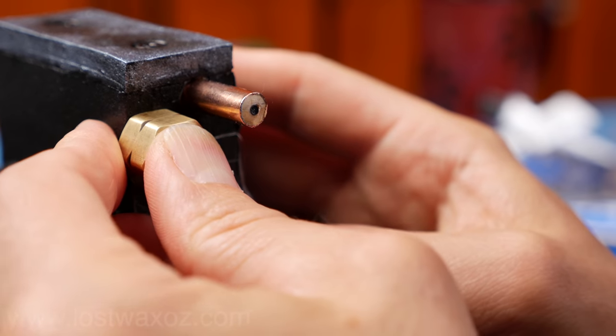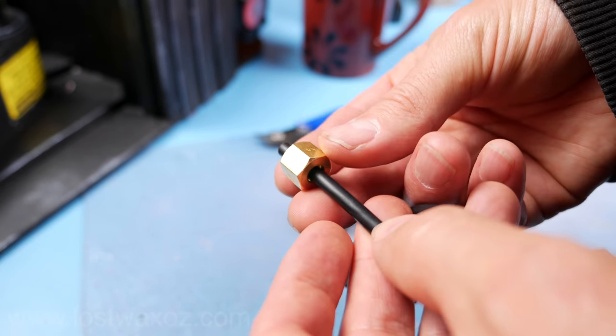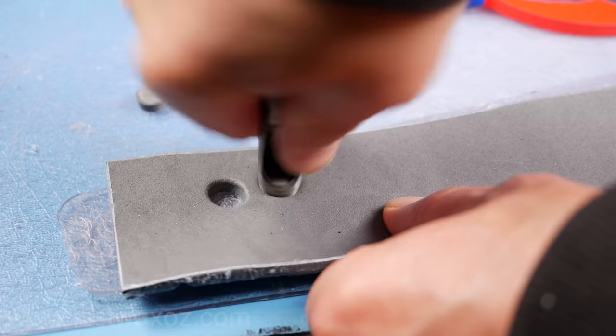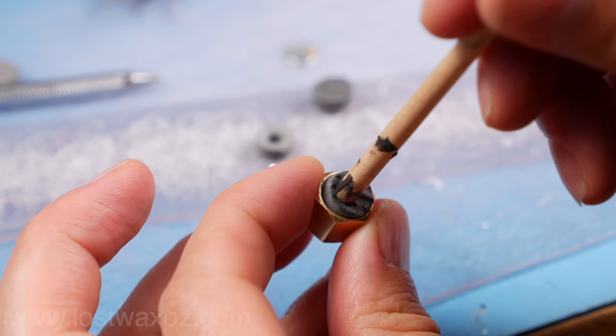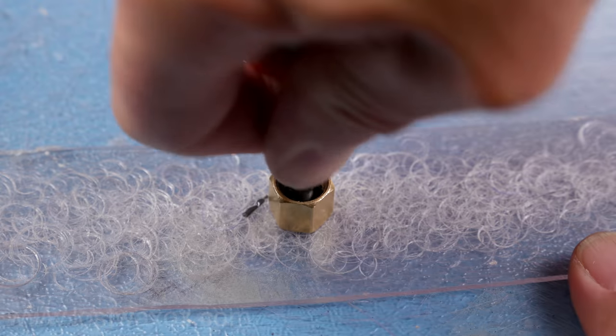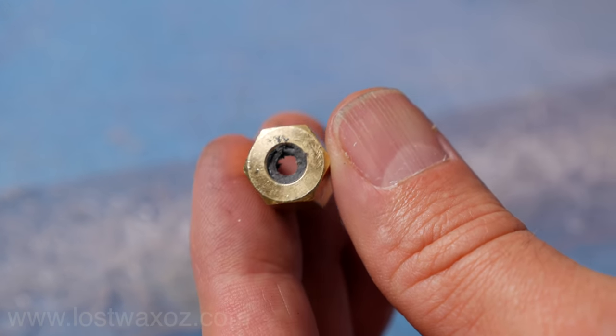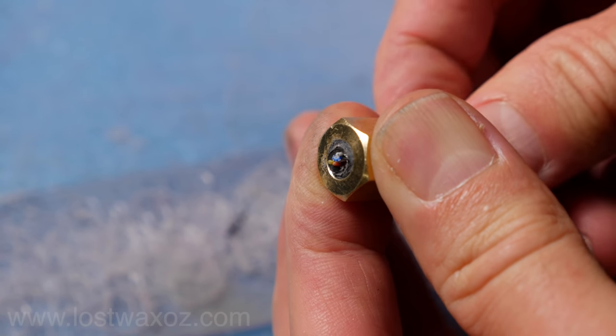The last two compression nuts are going to have the VGA wire coming right out of the center hole, but it's a little too big. So cut a foam disc and epoxy it inside the compression nut — do it again so you have two of them. Once the epoxy's cured, use a small punch right in the center to give yourself a little hole. Now when you slide the cable in, it's going to fit nice and snug.